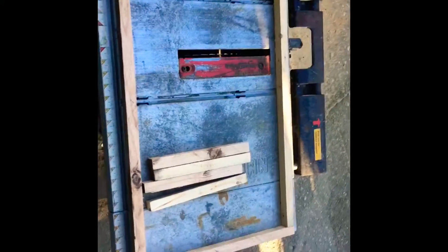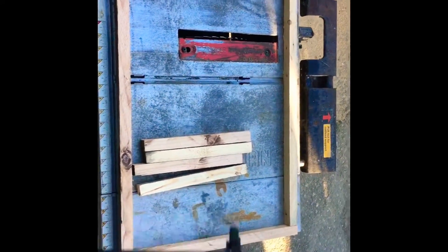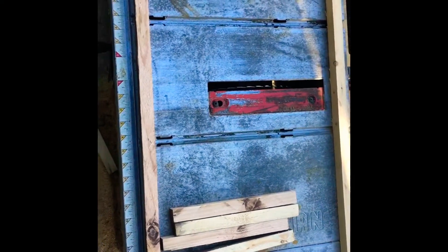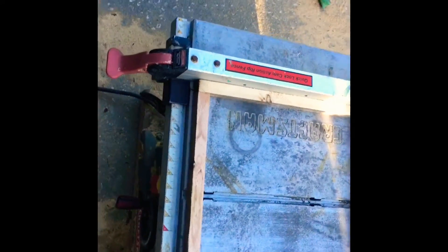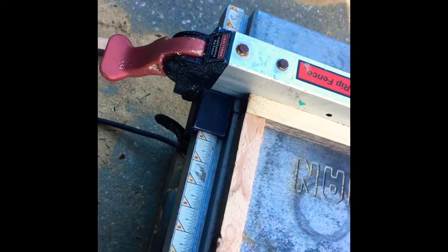Since I'm going to use my air gun with the 2-inch nails, the small ones, I'm not going to hold it like this and shoot. Instead I will use the fence — I will lock it like this, and then I just push with the gun from this side, and the other side I have the fence helping me. This is just for safety.